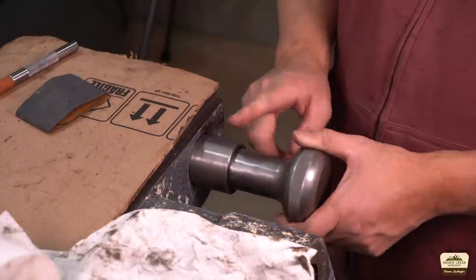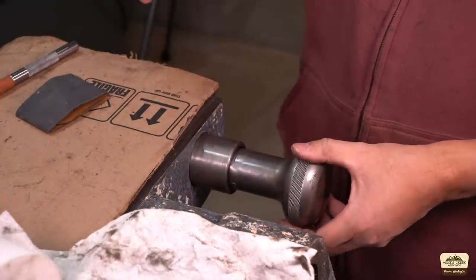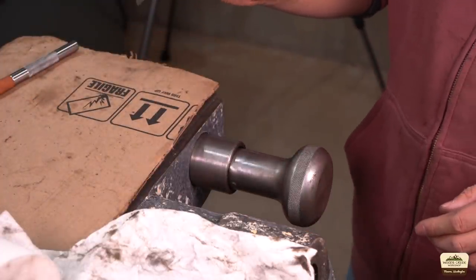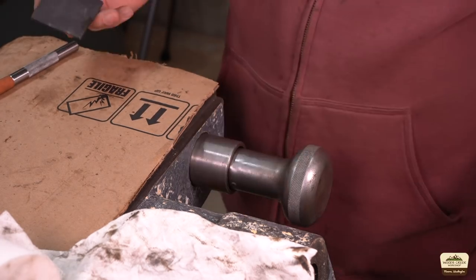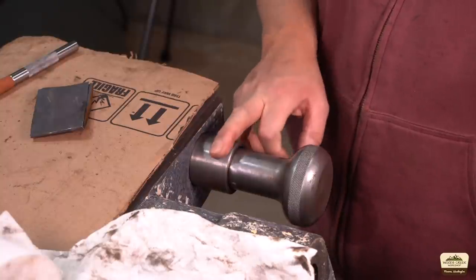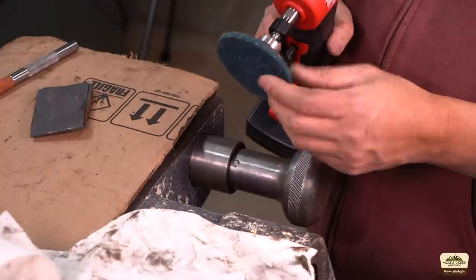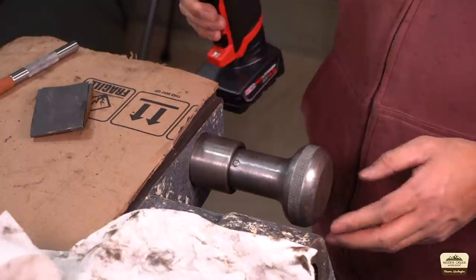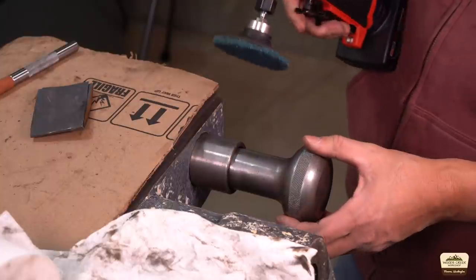Before we paint the saddle we do want to clean and polish these out so we don't accidentally damage the paint. My approach is using 500 grit wet and dry sandpaper. I went around and cleaned up the collar and I'll probably polish it more — maybe go to 1000 grit and then hand polish. For the rest of it I'm using a scotch bright wheel on an electric die grinder. This one is green, which I believe is more gentle than maroon.